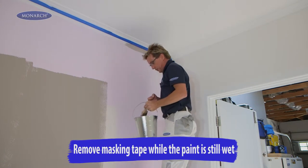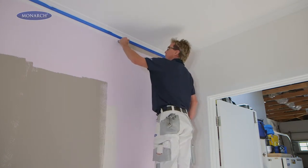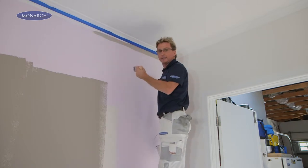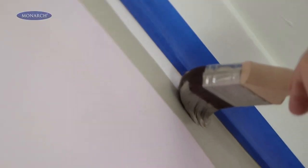Here's a professional tip for you. When you're cutting in with a loaded brush, go close to the edge first rather than right against the edge. Then use the quality filament of the brush to just lightly flow across the top of the wall, and you get beautiful straight lines.